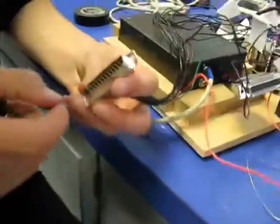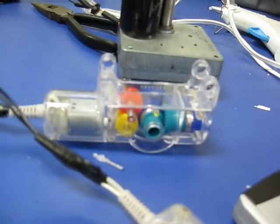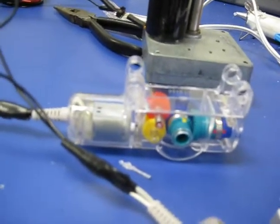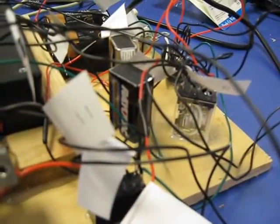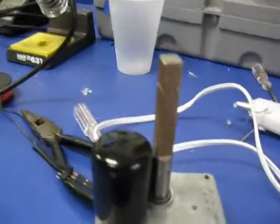So we're just going to show that everything works. We're going to cross the terminals — cross one and two. That's the first motor. One and two crosses — that's good. And then three and four will do a relay; that clicking noise is a relay. That is for this motor here, for motor one.